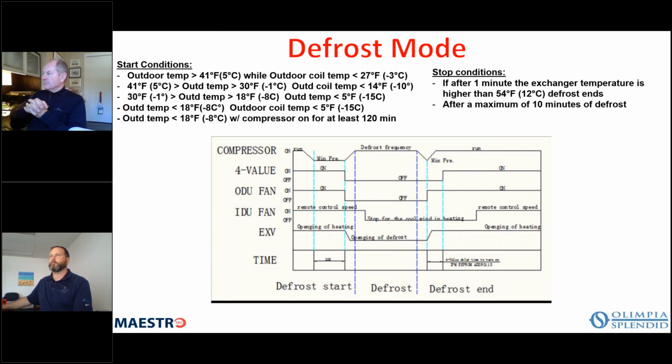Okay, so again, the maximum distance that you can have between the outside wall and the inside wall is 39 inches. And it has to be basically a straight duct going from inside to outside. There's no elbows allowed, nothing like that. But we're working on some alternatives there. And if you have something that's outside the box, let me know. Let's try to come up with a solution. Sounds good.